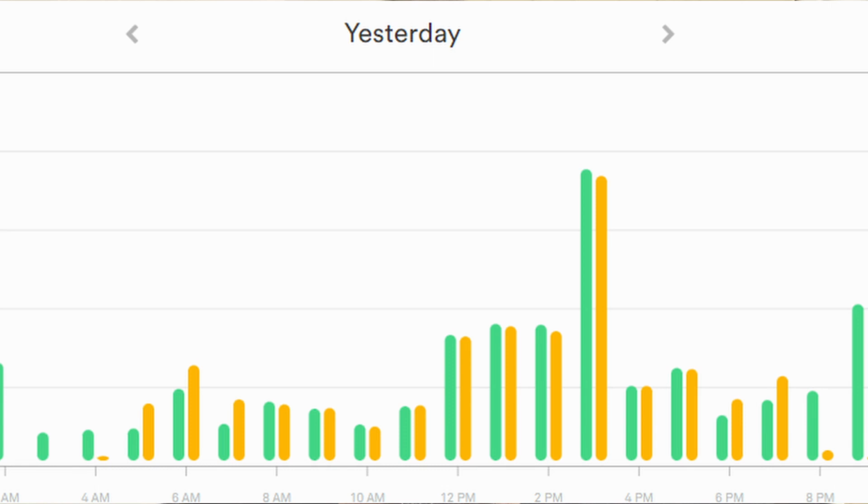When in anti-reflux mode, it should only dump enough to zero out your consumption from the grid. In a previous firmware update, it would aim for zero minus 100, so you're still pulling 100 watts from the grid. In the current firmware that I have on here, it tries to zero it out to zero, and it's pretty good. I end up pushing like 3 kilowatt hours to the grid and pulling like 1 or 1.5 from the grid. I don't think it's even that. I think it's like less than 1 kilowatt hour from the grid.